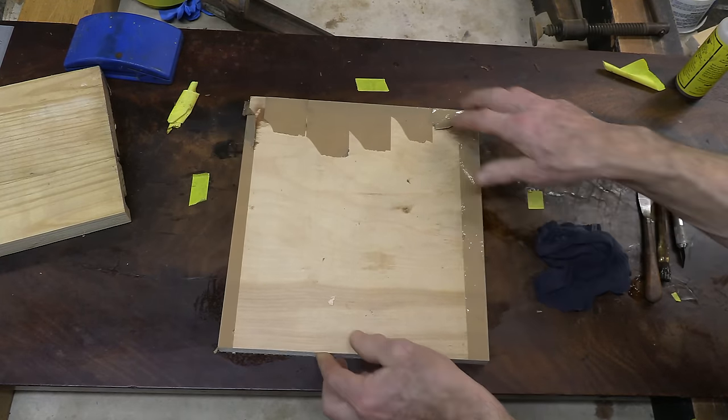Okay, I've let that glaze touch-up dry for about an hour, so I'm ready to put the third coat on. And once again, I don't need to sand. It's still soaked in an awful lot. And when I do put this coat on and go over the glaze touch-ups, I just go with one swipe. You've got to be careful that the varnish doesn't disrupt the glaze.